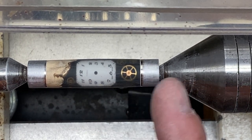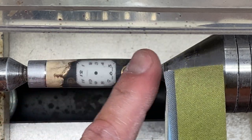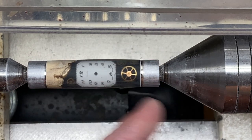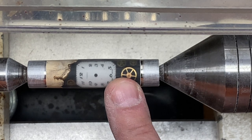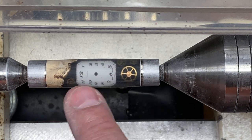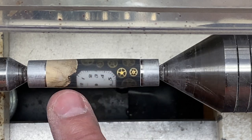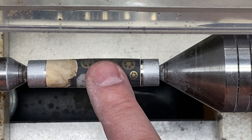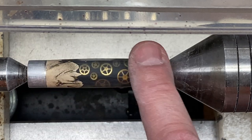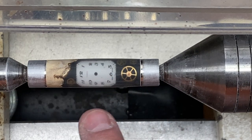So what do we do? There are a couple of options. For this particular instance, I'm going to use something called zona paper — it's a paper similar to micro mesh, but we can sand dry with it. Don't worry if you don't have zona and you have micro mesh; just use your micro mesh pads dry, sand your blank dry, and remove all the scratches you can see in the acrylic. At that point you'll have a super smooth surface and the acrylic blank would honestly be ready for just some wax and a good buffing. But because we have wood, we're going to finish this with CA. I never finish acrylic with CA unless it's a hybrid blank simply because it doesn't need it — why add the extra step? But in this case we have no choice; we've got to finish the wood. So we're going to CA the entire blank, and then after we've CA'd it we'll wet sand with micro mesh, get rid of all the ripples, and then we'll be ready for wax.